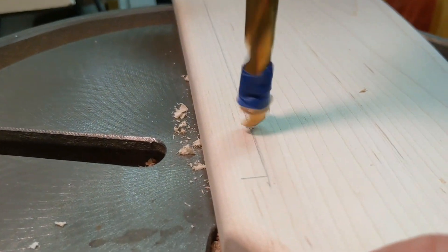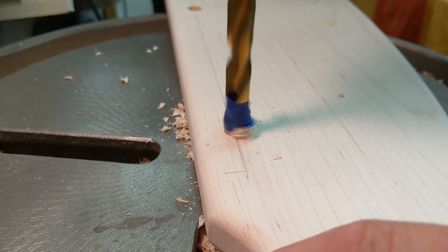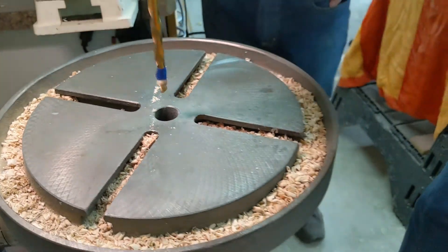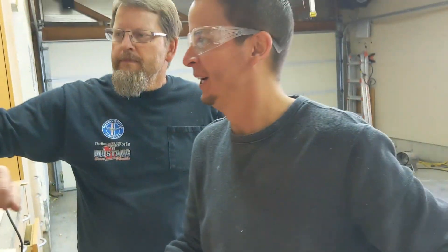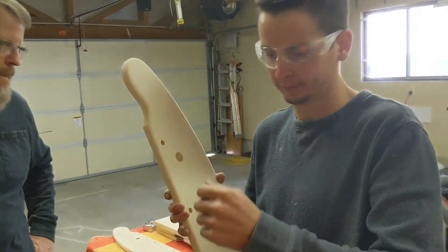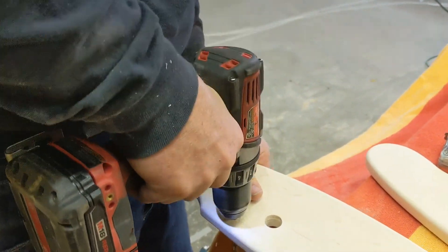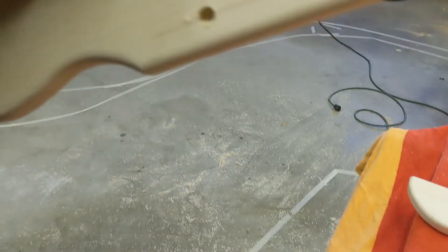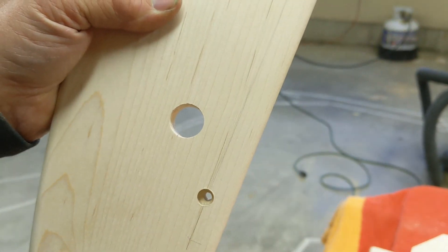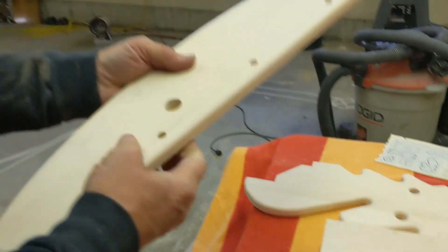Something I would have never thought of, but my dad's a professional — it'll make things look good. Taking a 3/16th bit, drilling all the way through — it's big enough that the screw will slide through here. Then we'll use a pilot bit in the wood we're screwing into, so it holds without splitting. It's gonna look nice.